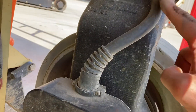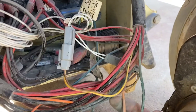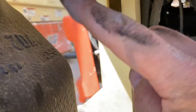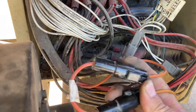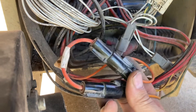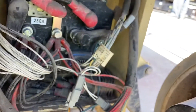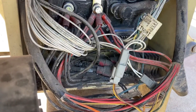Let's start with motor one — the left side motor. The harness comes down the machine and into here. Look on this harness and you will find a blue and an orange wire — those are the field wires for this motor. You can do the same for the other side. Inside you will find, again, a blue and an orange wire. You will see the orange wires have a jumper in them — as I showed in the diagram. Both these motors are hooked in series. So here's the secret: if the motors are hooked in series and one is bad, eliminate the bad motor and you can operate on whichever one is still good. The machine will actually perform relatively well. You can unplug that jumper, and it will isolate the motors left and right.